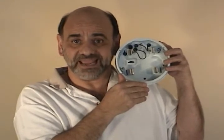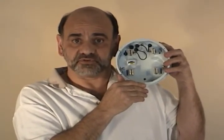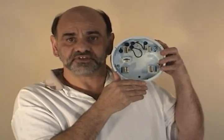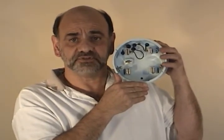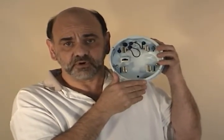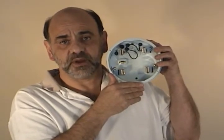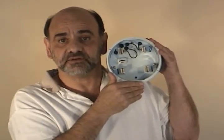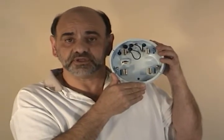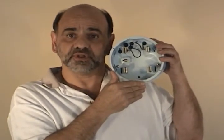One megabyte of memory is standard. The single-cycle adaptive store is a patented storage technique which enables our unit to record for 30 days, and if you have any single-cycle outages or anomalies that occur during that 30-day period we will catch them all regardless of the number of channels you have recording. With this massive amount of standard memory, we can record for as long a time as you need — typically at a house complaint location.